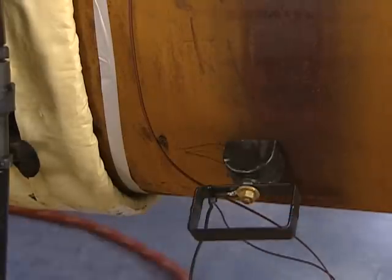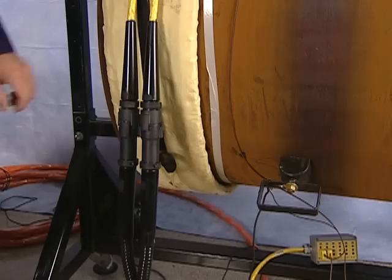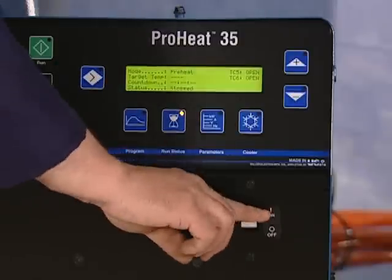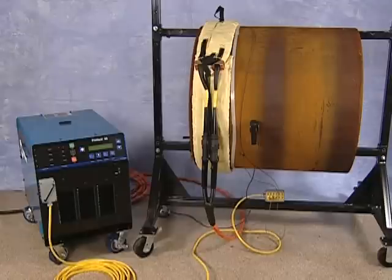Attach the isolation fault magnet to a clean surface. Isolation fault protection is provided to shut off the machine if either the heating cable or output cable shorts to workpiece. Never disconnect the blanket or cable connectors during operation. Always turn off the output power before moving or removing the induction blanket.